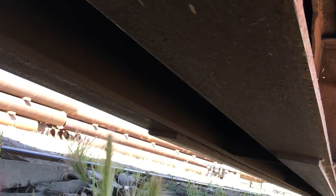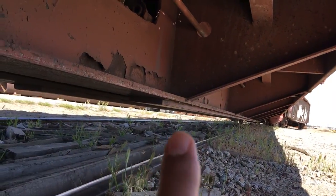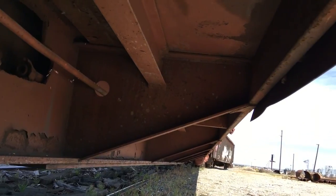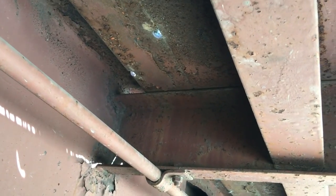The center sill is split there - that's pretty interesting. I'm going to stick my camera in there to see what's inside. We can see there's some reinforcement right inside there on the bottom - that's going to stiffen up this rail car quite a bit. Overall condition on the structural part is pretty decent.